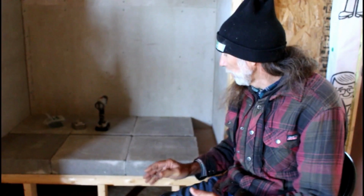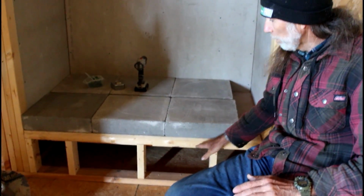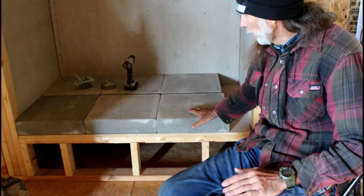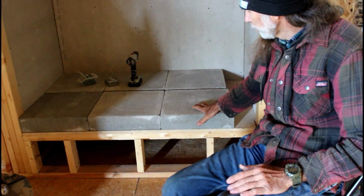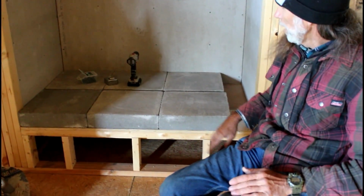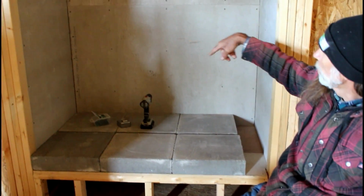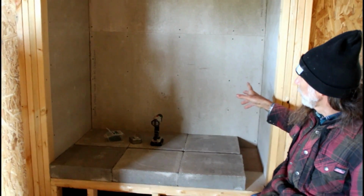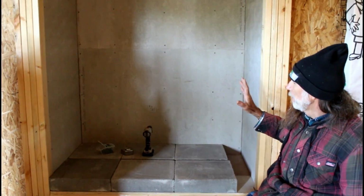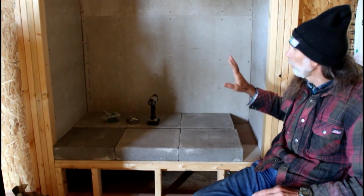And what I've done is I built a wooden platform down here using 3/4 inch Luan on top of a wood frame. I've come in and put these pier pads on it. They're 3.5 inches thick or thereabout, about 15 3/4 by 15 3/4. I'm going to put them all down in here, and I'll put the hardy board, cement board around the outsides of it because I don't want the heat getting directly to something that's combustible. I would rather have to go through something like that first.